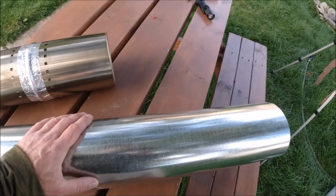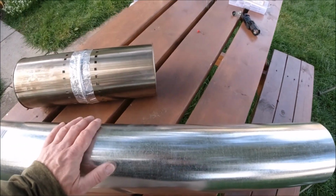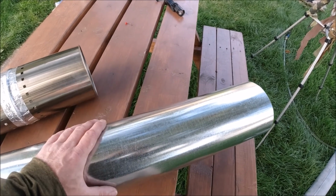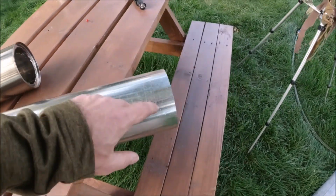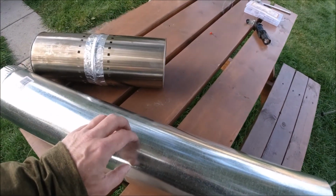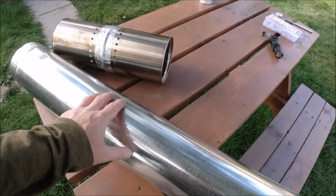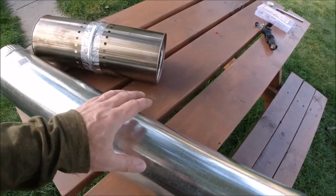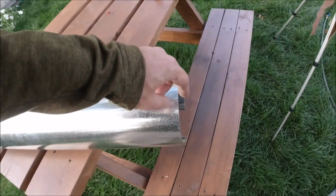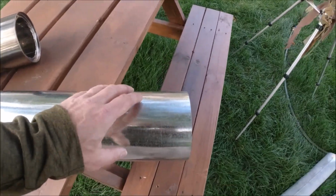You can actually get rid of the galvanized coating on this, and there's a couple of ways to do that. One is through extreme heat. The other is through soaking it in acid. And that sounds complicated and dangerous, but it's not, because the acid you want to use for this is regular old vinegar, 5% grocery store grade vinegar. So what we did with this, galvanizing, by the way, is only on the outside. It doesn't permeate through the entire metal.